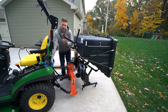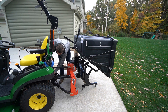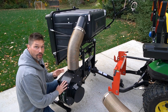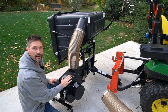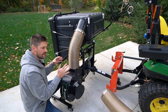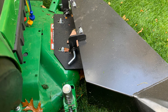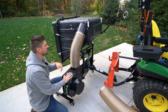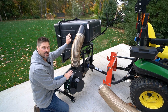While I'm thinking about this shaft — it will say in the manual, you want to operate this piece of equipment with that shaft just about as level as you possibly can. As you can see, we are completely disconnected from the tractor now. You can take a little bungee and just bungee up and tie off that PTO shaft if you want. Up there on the boot where it attaches and the chute right down here — it's just a couple of pins, the same kind of pins that are for these parking stands, that hold that boot on there as well.